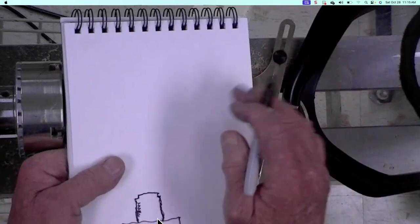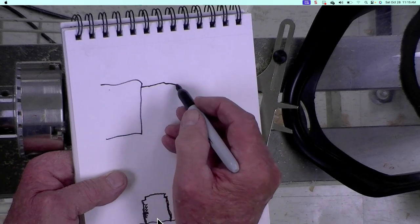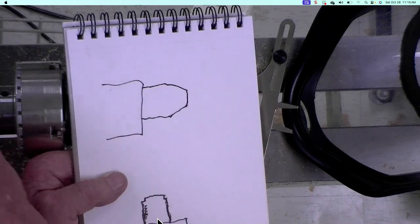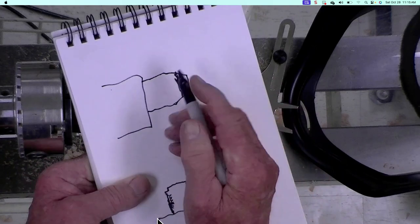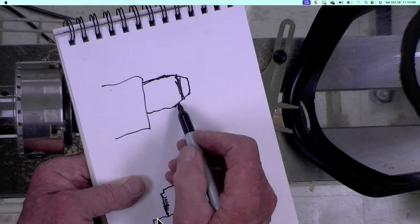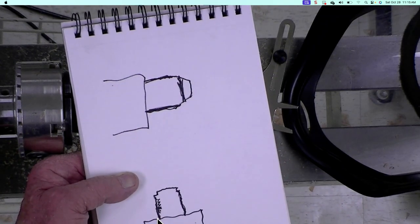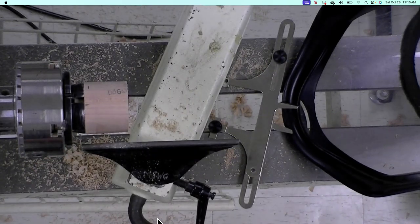Mike Mahoney does something different. He angles it down, and he puts this on here to get a rub going. And let's just say the rub is right there. Then he says, okay, eyeball it, and he takes it up a few notches, and then he turns this cylinder, the spigot, down to that, and he starts chasing threads. Got it? I just add 1/16 of an inch to it. There's a lot of ways to do it. I'm going to give you a couple more.